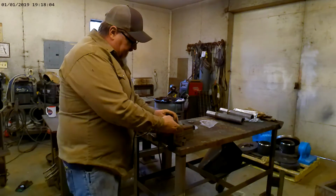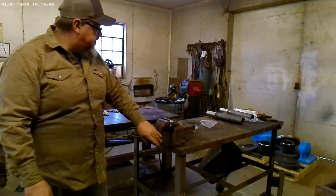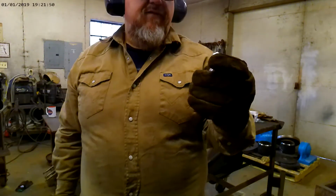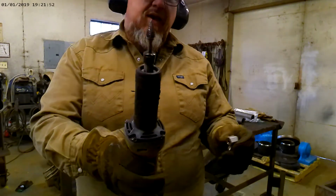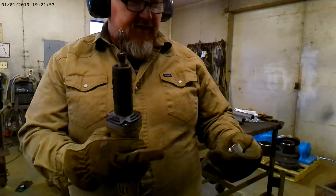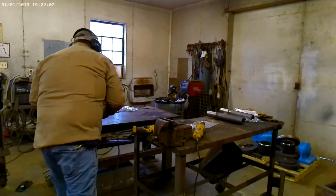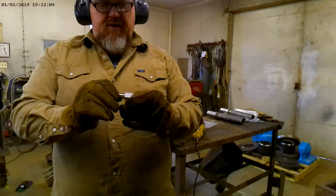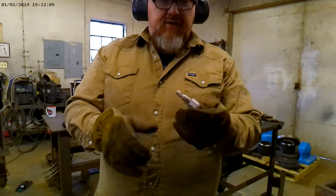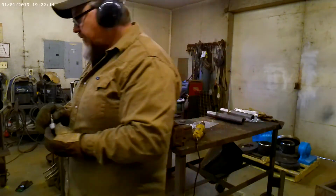We only have 10 of this style to do. And then we'll deburr the end so that the stainless steel fitting can fit in there easily. That works. We've got that very end cut off. And then we come in with our inline grinder with a burr bit, and we clean up the end so that the fittings can slip right in. They build them very precise, so if you leave any type of burr in there, it's not going to go together very well. So that's how we got that. We'll get all these cut up, and then we'll start welding them out.